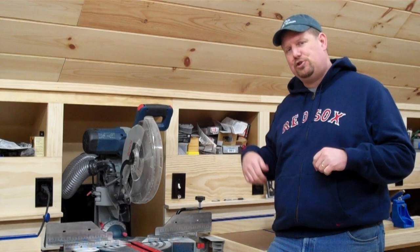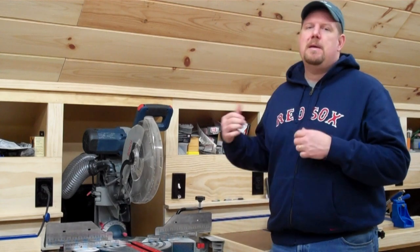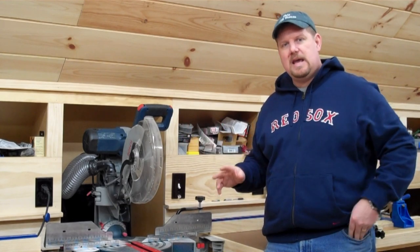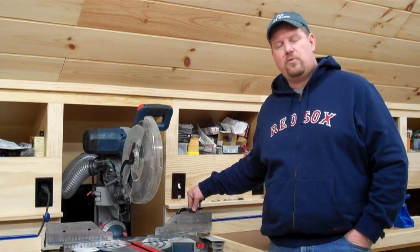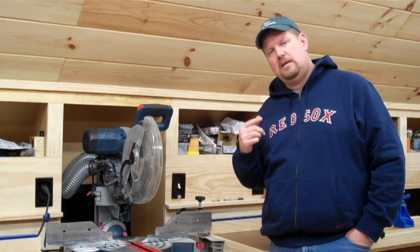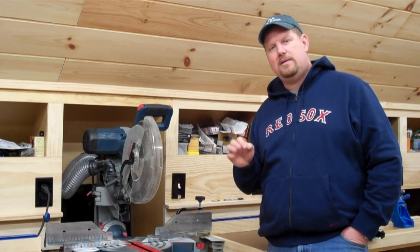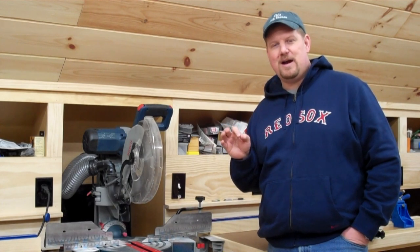It's even better than that — I can actually turn this on here, walk to the next station and turn it off there. So if I'm cutting a piece of wood at the miter saw, then I need to run it through the table saw. When I get done with the table saw, I can just simply shut it off there. I don't have to come back to this original spot. This is all set up with regular residential three- and four-way switches. I've used thermostat wire to create the circuit and run from a 24-volt transformer. One word of caution: the thermostat wire is very delicate — the first time we wired this and stapled it in place, we shorted that wire out. So be careful or use a heavier gauge wire. It'll probably save you a lot of time.